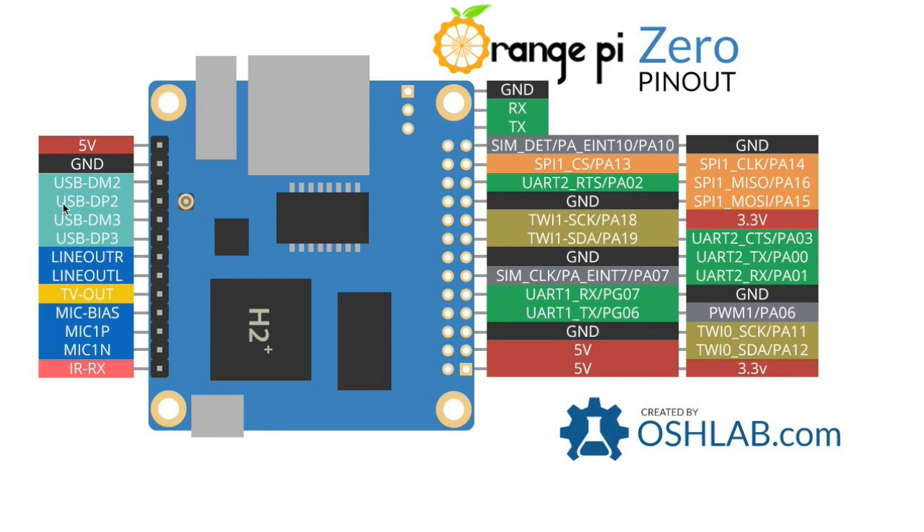The other con is I'm running DietPi, and with DietPi you have to fiddle to get the mod installed on boot for Wi-Fi. And then if you have more than one Orange Pi Zero, the Wi-Fi uses the same MAC address, so you've got to fiddle again to get different MAC addresses. I have not been able to get Raspbian to run — I haven't seen a specific Raspbian for the Orange Pi Zero. I've tried other Orange Pi Raspbians and the stock Raspbian, and I couldn't get it to run. Now Android — I do get a boot screen, but you've got to use their tool, PhoenixCard, to make the card, and you have to make some selections to configure it to get it to boot.